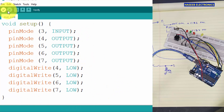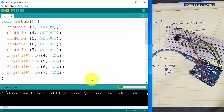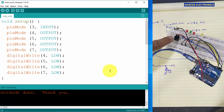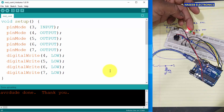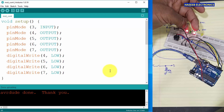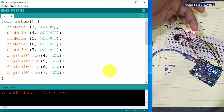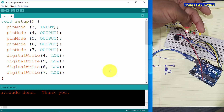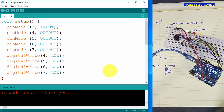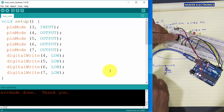The code is done. I will now save and upload. It is uploaded. The system is off — I will press the button to give a pulse. We can see two LEDs turned on at the same time: motor on, vibrator one on. Now vibrator two on, one off — motor plus vibrator two running. After eight seconds this turns off and the next one turns on. After eight seconds the system resets. We repeat one cycle again because at the end we give the setup command.